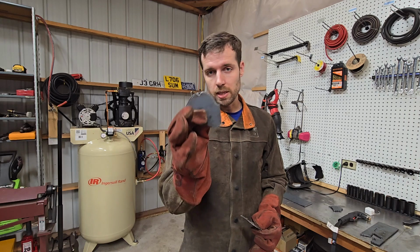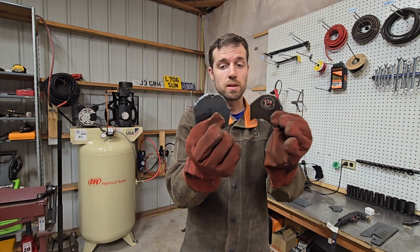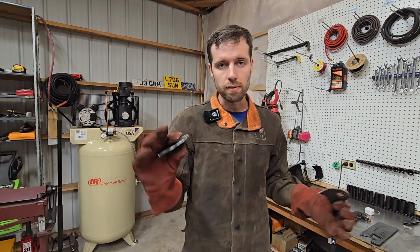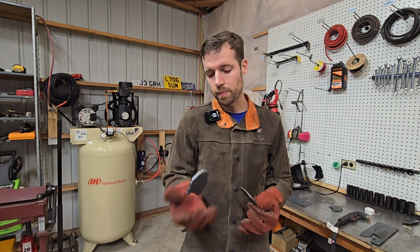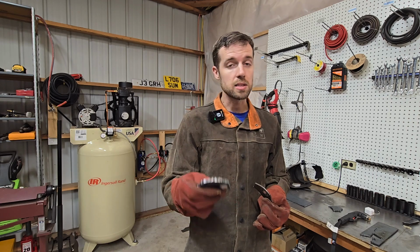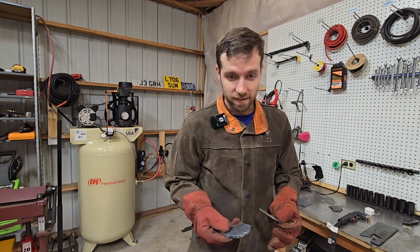That's bumping the power up. That's 65 amps, 100 PSI on the air compressor. So this is great. I definitely recommend, if you're going to go with this, you're doing 1/4" steel, take back everything I've already said. You want to go full power, 65 amps, 100 PSI, and you're going to get something that is as steady as you can possibly be. So I'm happy with that.